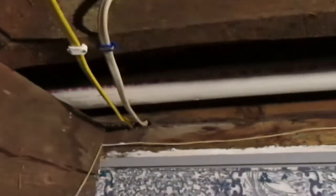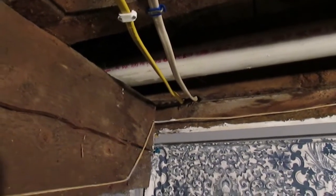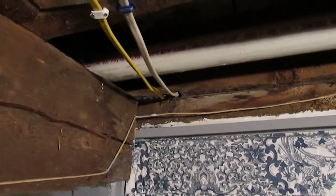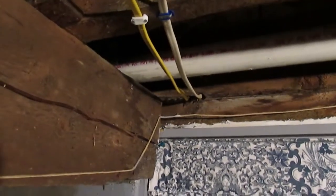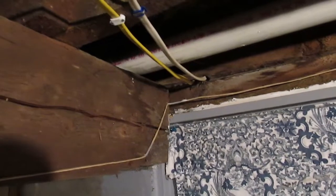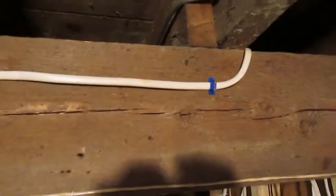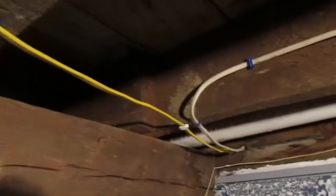And that right there, looking where those two wires go, goes up into the wall behind my refrigerator, and that is actually where that original knob and tube circuit passed up through, and it went to a 20 amp outlet that was behind the refrigerator. This circuit was powered off one 20 amp fuse originally, and there was a whole array of different wire. You saw the knob and tube wiring. There was 12 and 14 gauge wiring hooked to this, including the whole second floor lighting system, all 14 gauge.